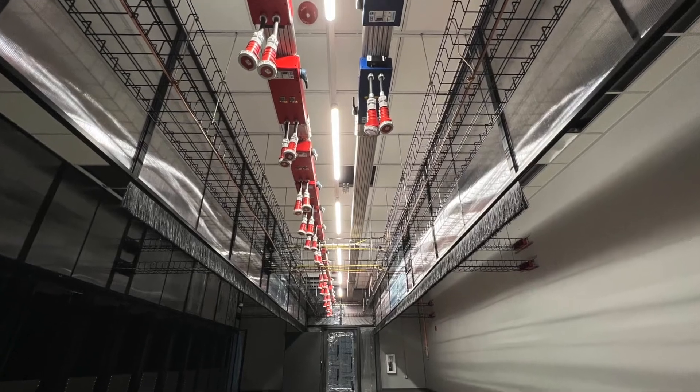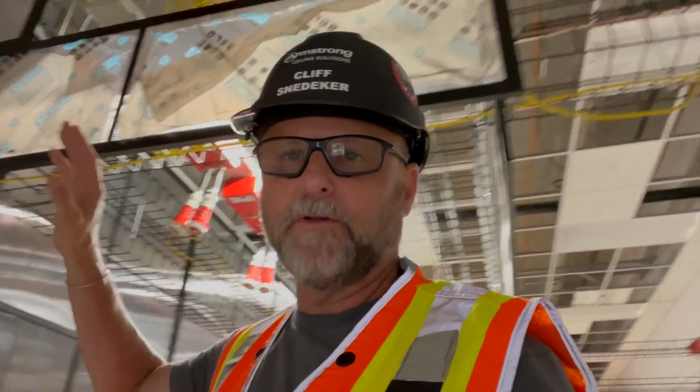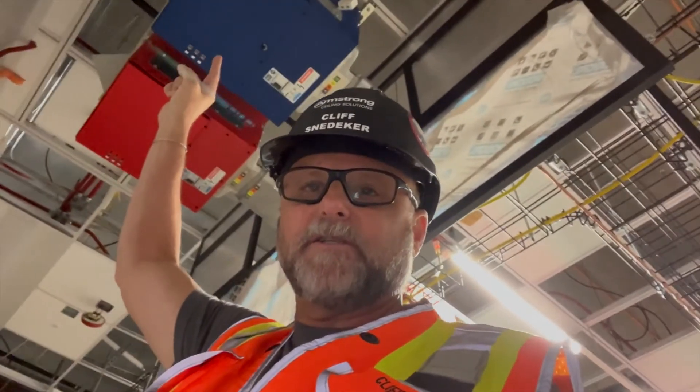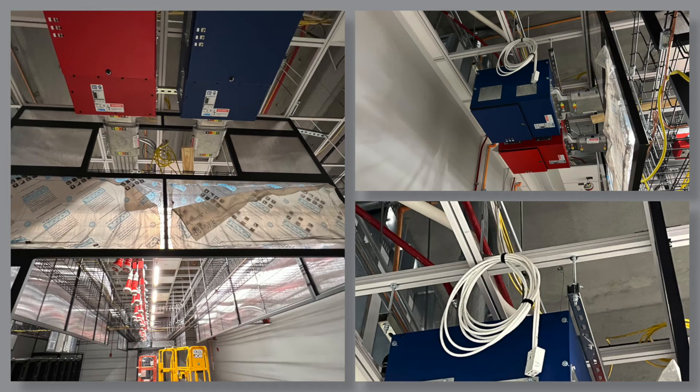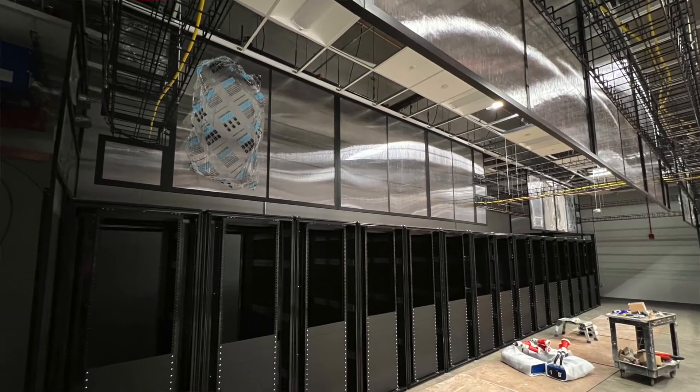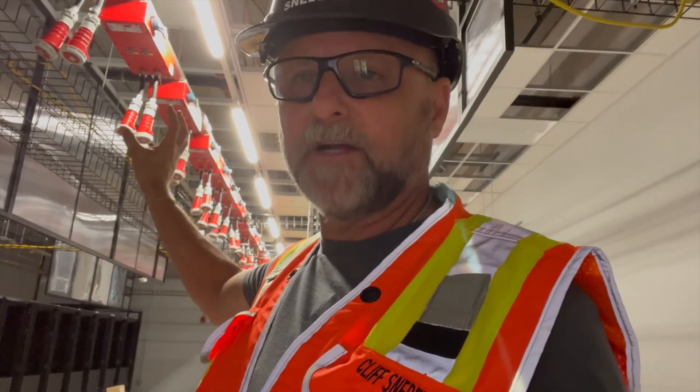We're standing at the end of a pod here. There's a more finished pod adjacent to us with the rack system attached to it. This one's better lit, so I want to walk you through the power management system that's attached to the Dynamax. Looking down the pod, this is all powered by a modular bus system in these blue and red boxes that are attached to the Dynamax grid. They supply power to the raceways that supply power to the bus plugs in this pod, and the racks that come in from below are powered by these bus plugs that are ultimately powered by this modular bus system. All of it is attached to the Dynamax grid.